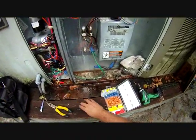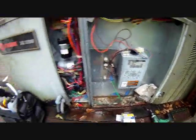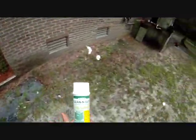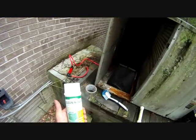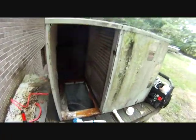We'll go ahead and douse the coil with coil cleaner, vacuum it off, douse it again, and start up the unit. I've used this one a lot in these sorts of instances. When I clean evaporators in place, I typically use something like this — it seems to do a pretty good job. There are some that don't do as good of a job, but I like this one.